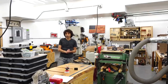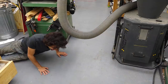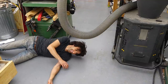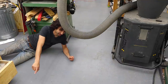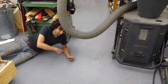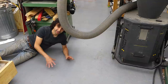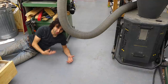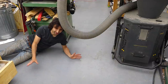That is the electrical. Let's talk a little bit about heat. This garage was installed with an in-floor radiant heating system. There are plastic pipes — PEX tubing — in the concrete, and hot water is circulated through the pipes, which heats the slab, which then becomes a giant radiator and radiates heat into the area. Everything touching it becomes a radiator as well. It's just a super even, super nice way of heating a space.